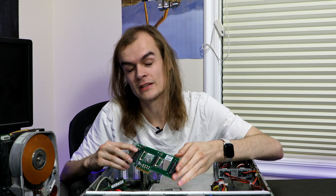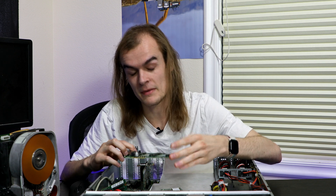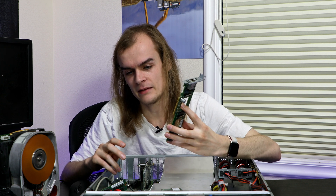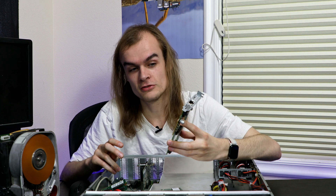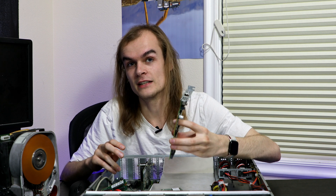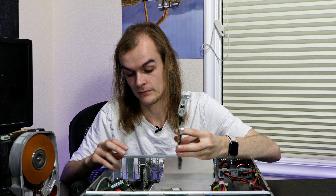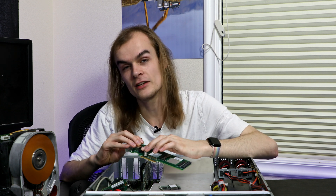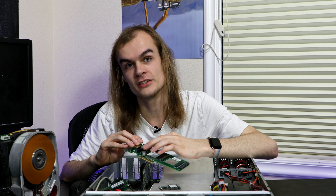With a lot of newer motherboards having M.2 slots on the board, it makes more sense to use an M.2 slot if you already have one. But if you can get one of these really cheap on eBay, it's pretty good if you don't have an M.2 slot and want a little thing to hold some small SSDs as boot drives. Thanks for watching this video about one of my little eBay finds, and let me know if you have any idea where this connector goes in those Isilon systems.